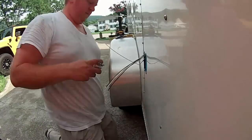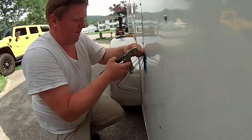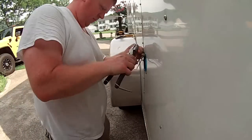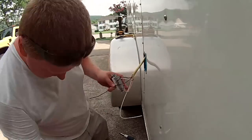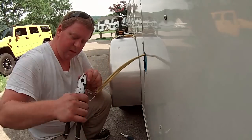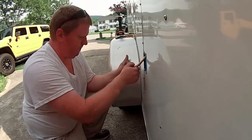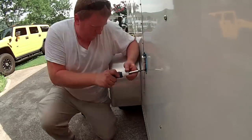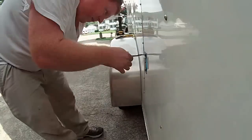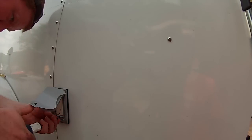So what we're doing here is we took a regular outlet and cut the little bar out that separates the top and bottom so they can be independent circuits. These are going to have two incoming circuits — he'll wire the black and white of the first circuit to the top, and the black and white of circuit number two to the bottom. That way he has two individual 15-amp inputs. We'll make suicide cords — everybody hates those, but as long as you plug the trailer in first you're fine — and run that from the outlet to the breaker box. Two inputs on one little jack. Watch — I did mine with silicone; it's the best way to do it.